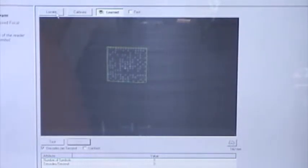We're in what's called the Easy Mode right now. Starting from scratch, we hit Stop. The first thing you do in Easy Mode — you can see a little cross on the screen, which is a target being displayed on the can so you can get it aligned. This is where you can see what your image is going to look like with the light. Once it's roughly centered, you jump into what's called Calibrate. The calibration adjusts the liquid lens, the lighting, and the shutter speed, testing all kinds of different scenarios and coming back with its recommendation.